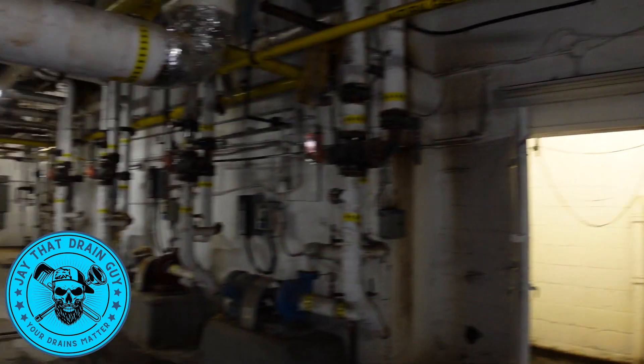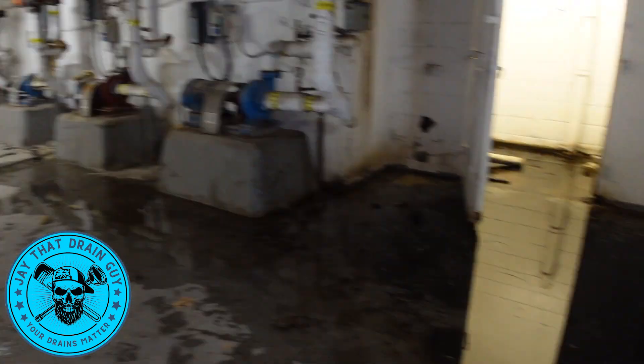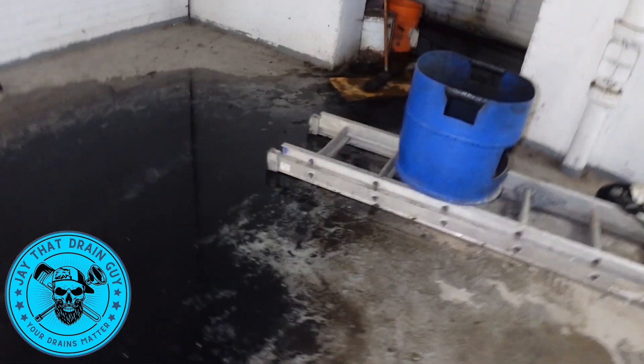So multiple drains would tie in before hitting the trap and then it would trap. I don't like that because a lot of times they bury them — such as in that room — and you can't actually access them. This room did flood, and you can obviously see the black water.